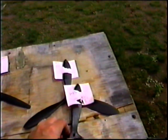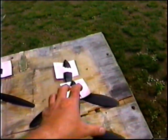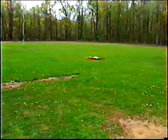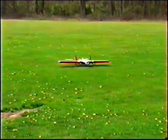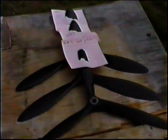But the exact opposite thing happens on the BY&O. On the BY&O, because it's a tremendous load and it's a heavy prop, by thinning out the blades and lightening the prop, it gets more drive. So we've walked into a hornet's nest, of course. And this is why you have to do all the tests. And this is only the beginning. We haven't even started. The situation is to just try each prop in duplicate, one undercambered and one not, and see how they work.